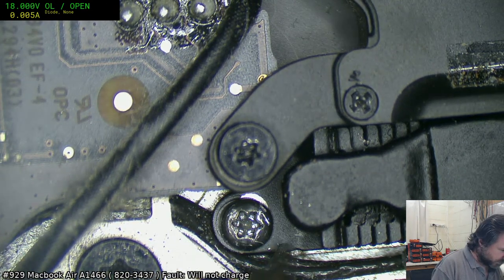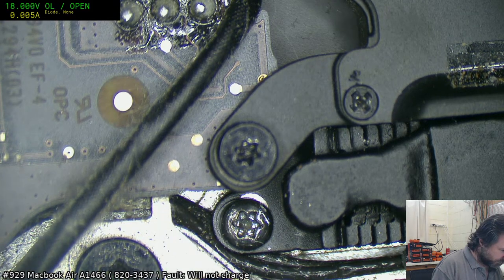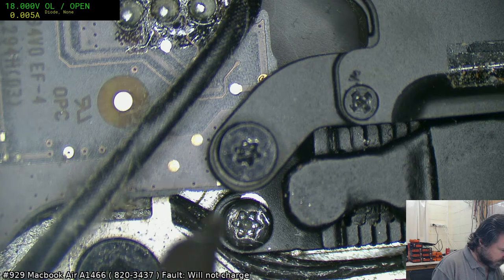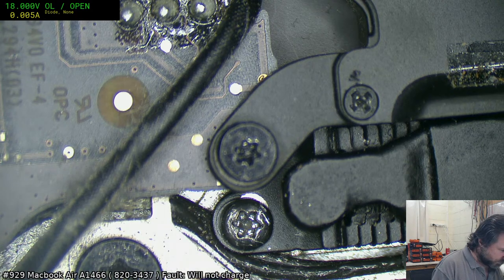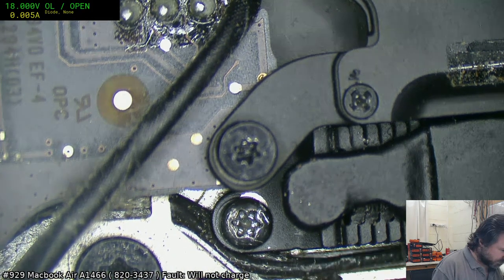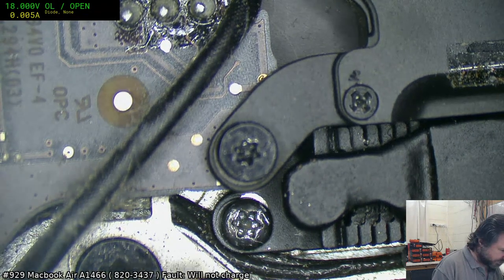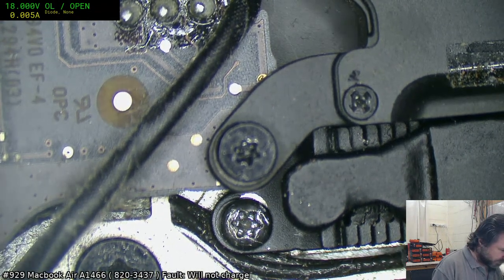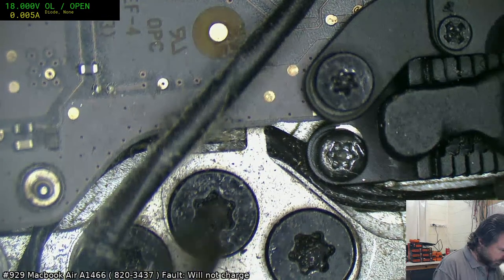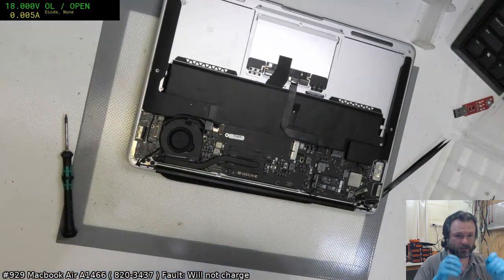See how that is pinched under there? You've basically crushed the shielding of that cable into the core, most likely. You're going to have reduced signal strength, amongst other things. Okay, don't do it. Be smart. Pull this cable assembly out, screw this down to the chassis, and then put this cable back down. It means you've got to undo these two here. It's a small thing to do compared to redoing the entire antenna assembly.